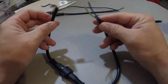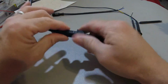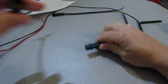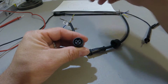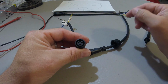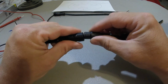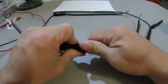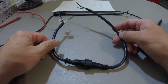And so what I plan on doing is going through each and every one of my pigtails, making sure that all the connections are correct. So I will start, as I just did with each and every one of these, to make sure that the top left is going to be hot, the bottom is going to be the data, and the top right is going to be ground. I'll test each and every one of those to make sure that it flows through to the other side. Once they're correct, I'll go ahead and put them away. That way I won't have to worry about testing them again. I've already done it once. And then at that point in time, I can just pick out whatever I need, put them on my controllers, and put the other ends on all my elements.